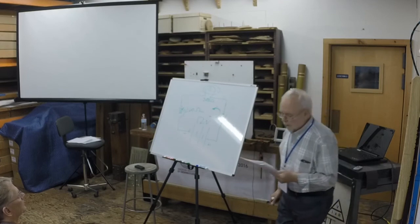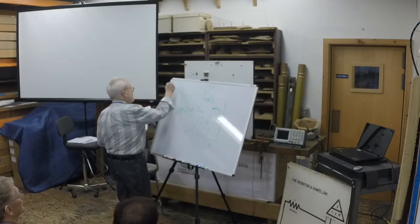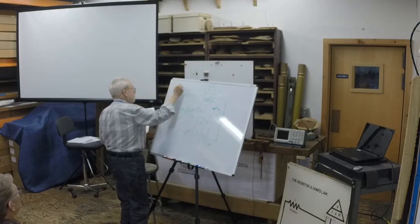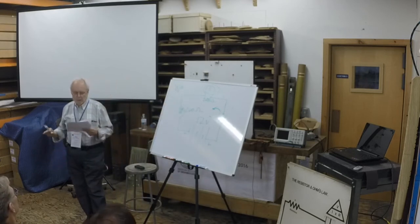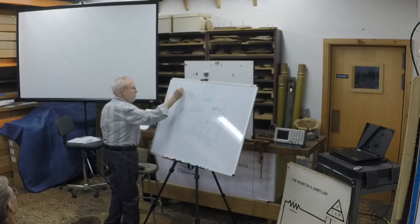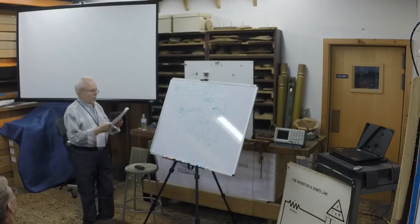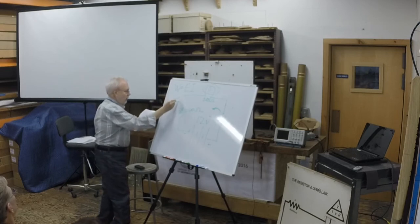Here we need to introduce the second important equation, which gives us another letter, W, for power, which is measured in watts. I understand that Mr. Watt had something to do with steam engines a long time ago. Anyway, the symbol W for watts is equal to the volts, which is E, times the amps, which is I. It can also be written as W equals I squared R.